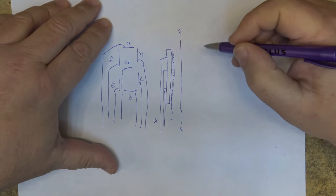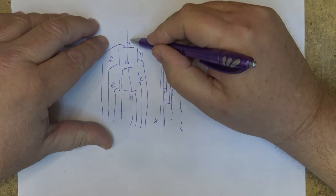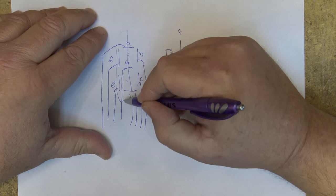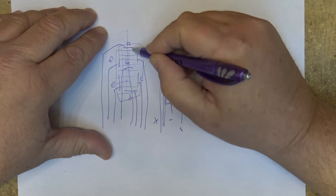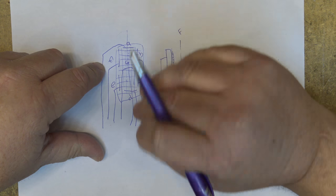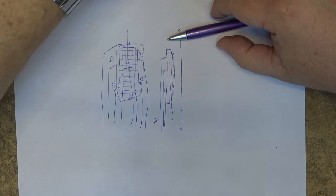The screen mesh is given a negative bias voltage while the anodes are at positive voltages to control the actual segments. The filament is given either an AC or DC voltage. The filament gets hot and, being in a vacuum, causes electrons to be emitted — these are attracted to the positive plate. The screen's negative bias tries to repel the electrons so they don't land on the anodes until the positive charge is sufficient to pull them through the grid.